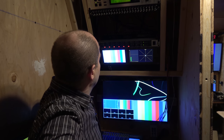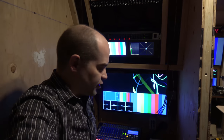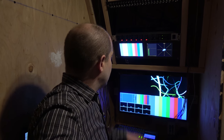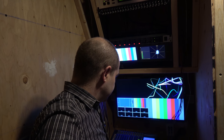The other source I've got connected on channels 1 and 2 is the intercom within the trailer. I can listen to what the director is saying, or anybody else on intercom, which is very helpful especially if I happen to be running a PTZ camera back here in the audio booth. There is also a set of connections here for intercom, so in the audio booth I can also talk back to everybody. Having that intercom feed come into this mixer means I can mix it into what I'm listening to on the speakers and be able to work on the mix while at the same time getting direction from the director.